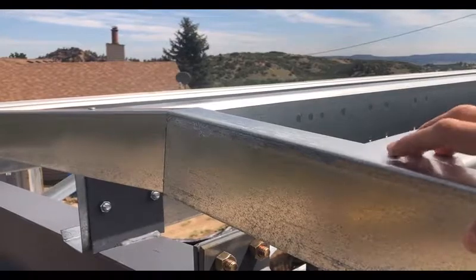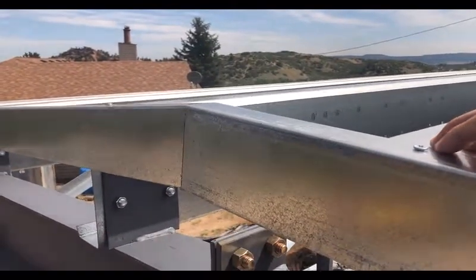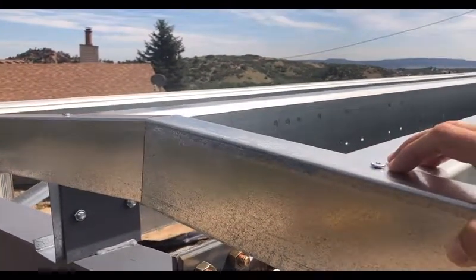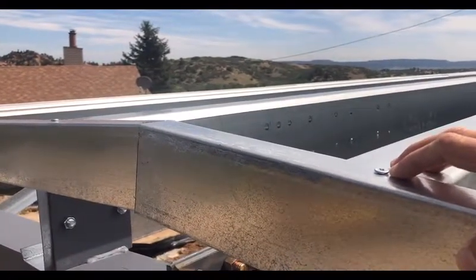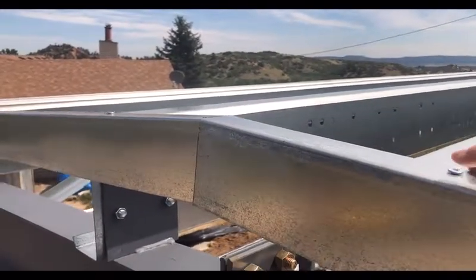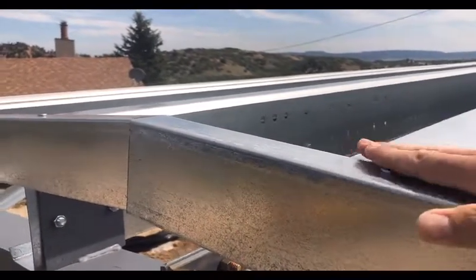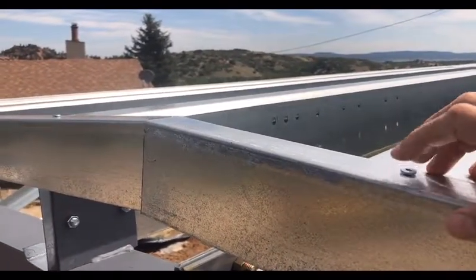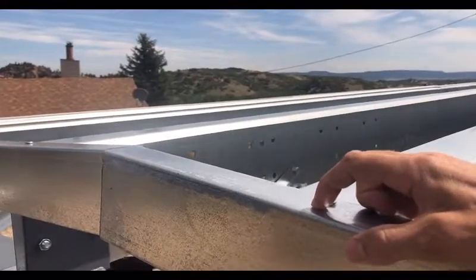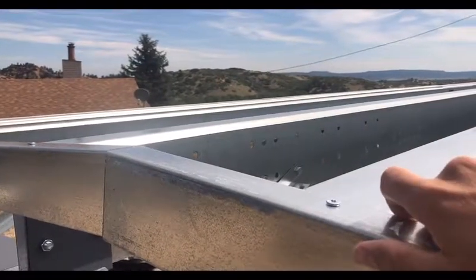The erector on this job has used a pancake screw which has been provided by Great Western. You can use the hex head self-drillers. You want to get these screws about as far to the edge of the building as possible. The pan heads are nice because they won't interfere with the panel as much as a hex head. But if you put them all the way to the right place on the edge and you hold your roof panel modulation, there will be a high rib on the panel that comes over it, so it really shouldn't interfere anyways.